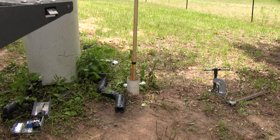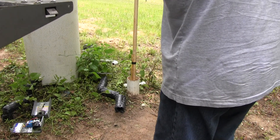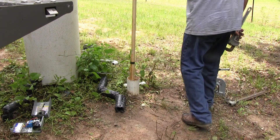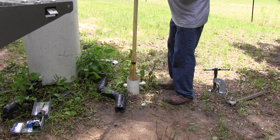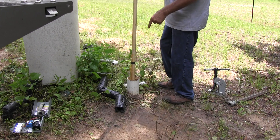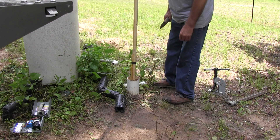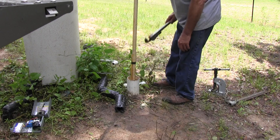What we have here is a stuck pump. We refer to this as a burn-in. This is about 17 pieces of 1-inch PVC Schedule 80 with steel connections attached to the pump, which is 320 to 360 feet down inside of this 4-inch well casing. I didn't install this pump.